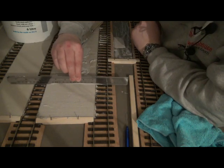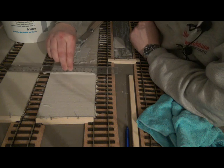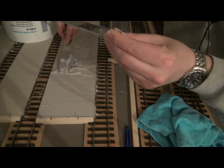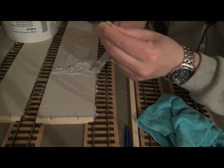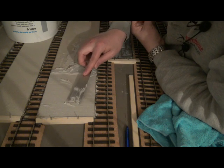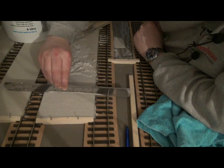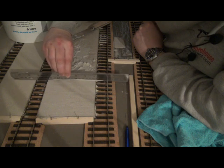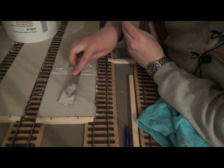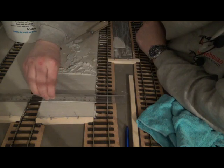Going back over where you've gone, then keep going, keep working it. Nice slow movements, levelling the plaster off as you work backwards. It's really just a case of working in small areas. If you've got a couple of depressions, all you do is go back over, fill the holes in, and then just work your way back. It does take time, it does take quite a bit of work. You'll keep finding holes and depressions as you work your way along - just a case of going back.